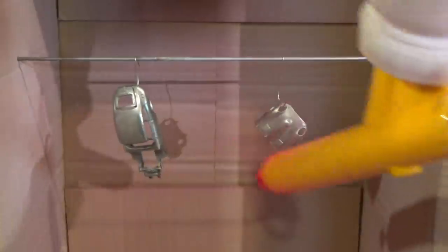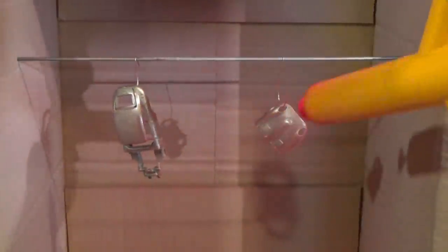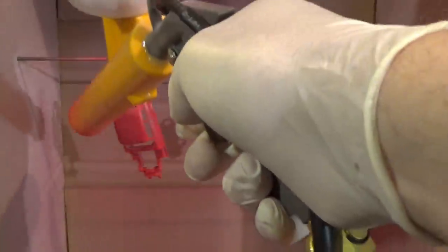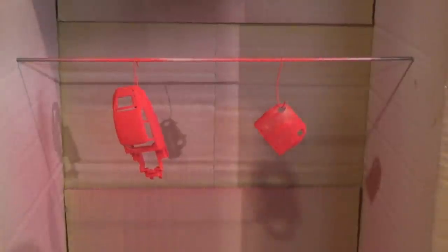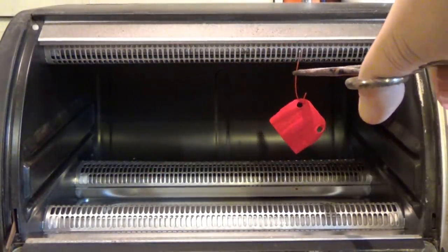I then attach the copper clamp from the powder coating system to the rod. Now that my parts are dry and clean, I can hang them on the rod and hook up my gun to an air compressor. The Eastwood uses 10 psi max, and the Harbor Freight version I'm using here uses 30 psi max. The parts I'm coating are really small, so I don't need anything close to the max psi. With the air attached, I hold down the button and turn on the voltage, and pull the trigger of the gun to begin spraying powder. Since the powder has an opposite charge to the parts, it will be attracted to them and stick, the same way a balloon sticks to the wall after rubbing it with your hair. It's best to spray around the parts and not directly at them, sort of like making a little cloud of powder around them. Once you can't see any of the metal shining through, the part has been coated.